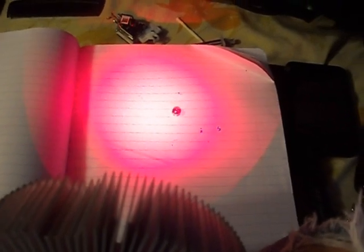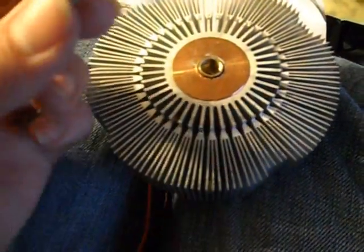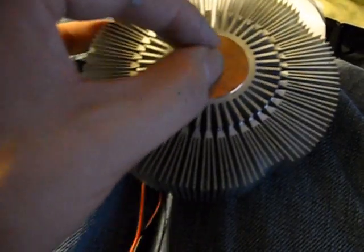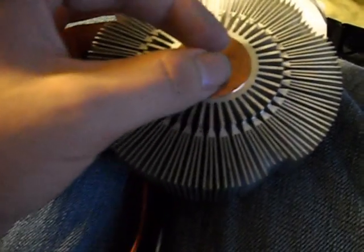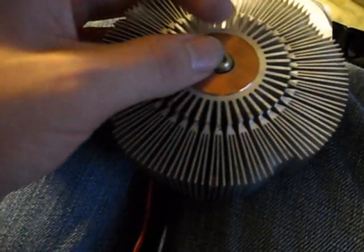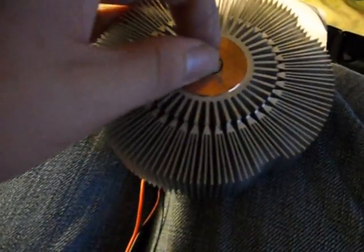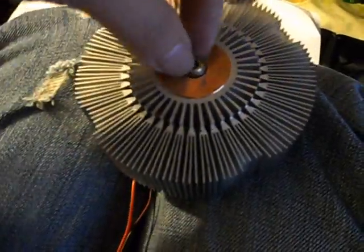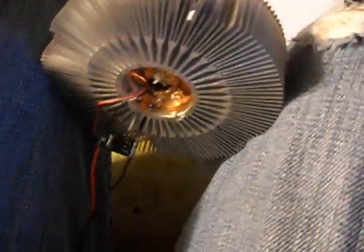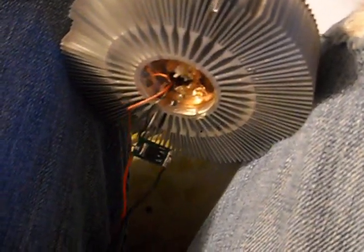Let's put on a lens and test out its output with collimation. This is a mounted collimating lens for the laser — I'm going to screw this into the threads inside, which will let me focus it into a beam. The last thing I should have to do is set my lens adjustments and focus it. Let's fire it up and shoot it at the piece of paper.